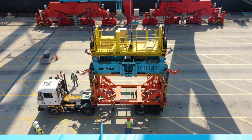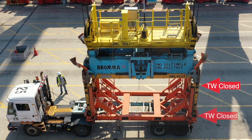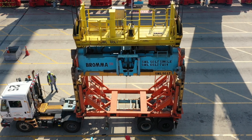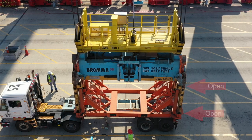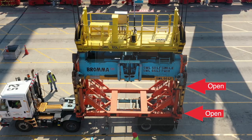In this frame design, when the parent spreader twist-locks open or close, the twist-locks on the frame do so in tandem with the parent spreader twist-locks. But if the frame were to leave the cradle at this point, the twist-locks would be closed and unable to lock onto a load. So the crane spreader must lift up the frame and move it to a second position on the cradle, where when the parent spreader opens its twist-locks, it also opens the twist-locks on the frame.